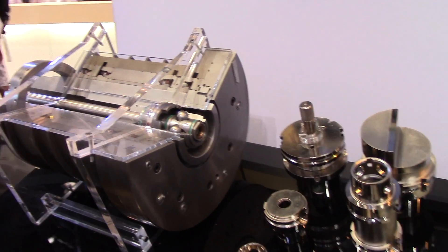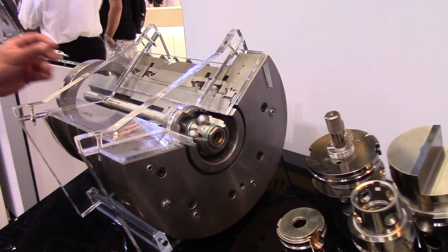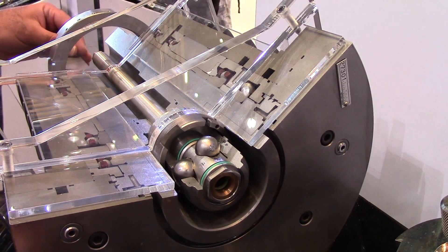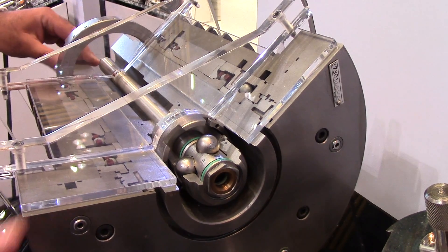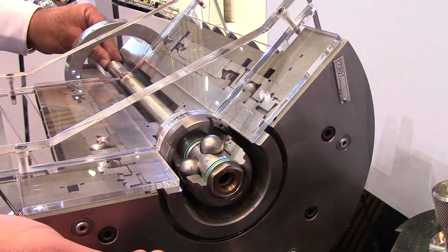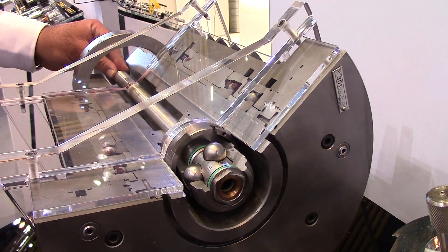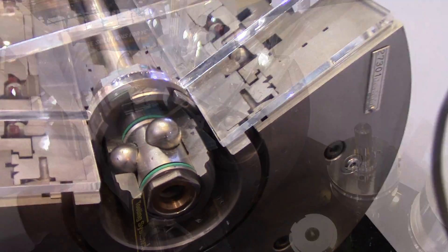Another aspect that we incorporated was mechanical advantage in the ball tracks. The way the spindle works is you have your traditional drawbar that pulls back on the clamping unit. In most spindles, there are fingers that expand as you pull the drawbar back. Our approach is using four hardened ball bearings on a ball track, and because this ball track has an angle, it acts as a lever. On our 63 millimeter format, our ratio on the lever is 4.8 to 1.